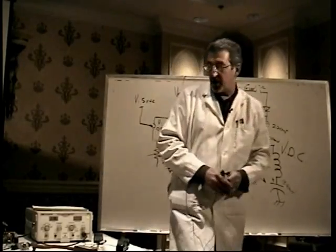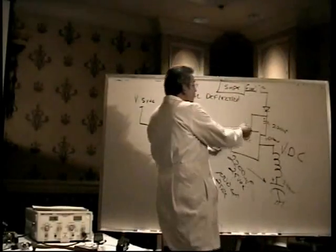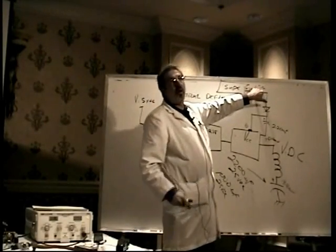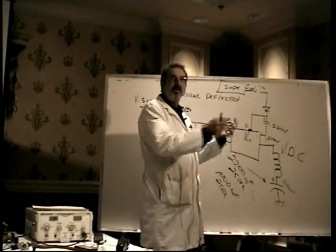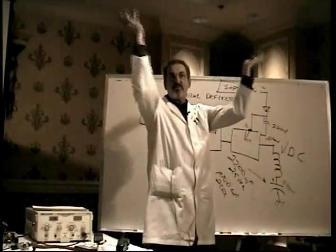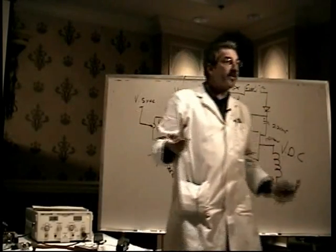So here's what happens. You go, okay, I have a horizontal line on the screen. Sure, easy. Power on. Pin 6, 26 volts is missing. Turn it off. Measure the resistor. Oh, it's open. Cool. You stick a new resistor in there, you fire it back up, and as soon as you fire it back up, that new resistor you just put in there smokes. And you go, oh, heck. Well, you probably say something more than that.